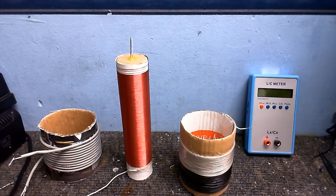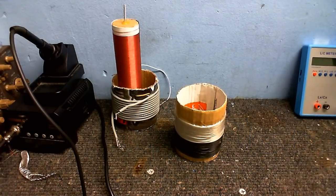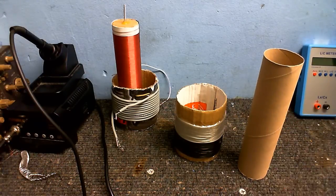And now onto everybody's favourite part of making a Tesla coil, be it solid state, spark gap or tube, the secondary. Oh boy, this is why I've been holding back on this video. Now when it comes to winding your secondary, you're going to need something to wind the wire around, and for most people, a cardboard tube would suffice, but in many cases, cardboard is not really the best kind of thing